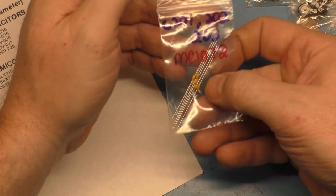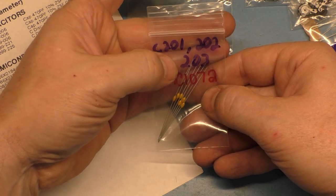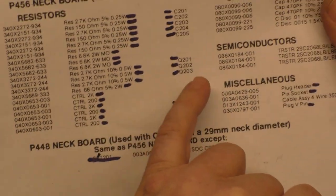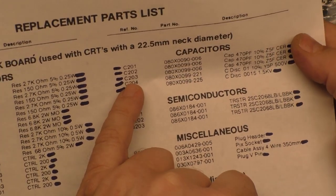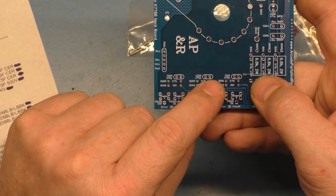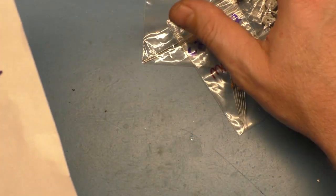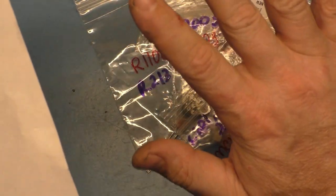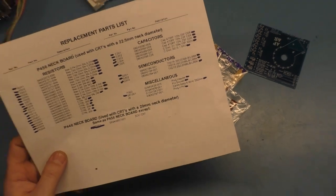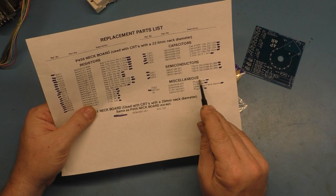So again, for instance, MC1072 corresponds to C201, C202, and C203, which are these 470 picofarad. And those go right here. I'll put down in the description the list of all the part numbers and the quantity. So when you see that list, order everything on that list, and that should be everything that you need to put this together. And I will say, though, there is an exception. I do not have a correct part number to correspond to the plug headers. Let's zoom in here.